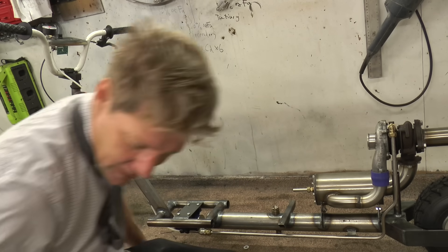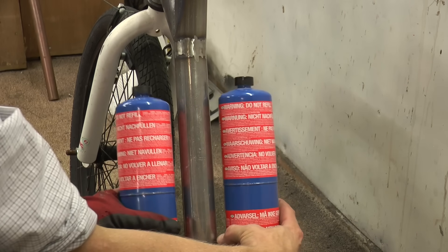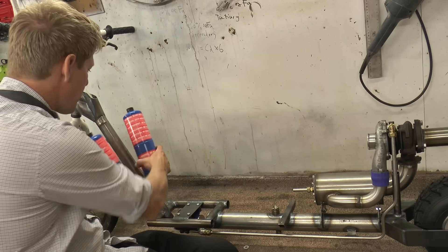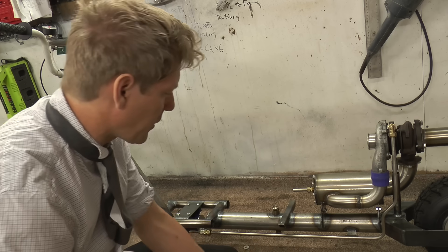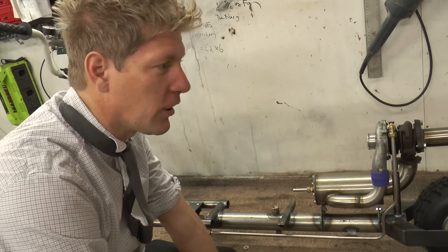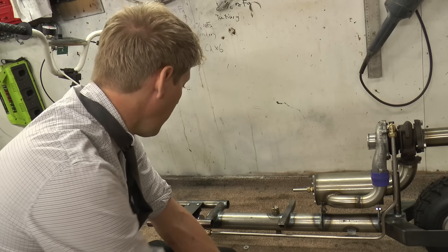The next thing I need to do is the gas system. I'm not going to fill it up with oil and test the oil system because I don't want it all full of oil dribbling out everywhere. I've got these two propane cylinders — I'm going to put them either side of here. We're probably going to need two, because if you try to draw too much gas out of one, they just freeze up and give nothing. I think we'll have two inlets: a regulated one for idle, and then a solenoid valve which just blips full gas pressure into it — so rather than a throttle, it'll just be a button. It might work. This whole thing's a massive experiment — the turbo could be too small, the oil system might not be up to it, and the throttle might not work. Good project, Colin.